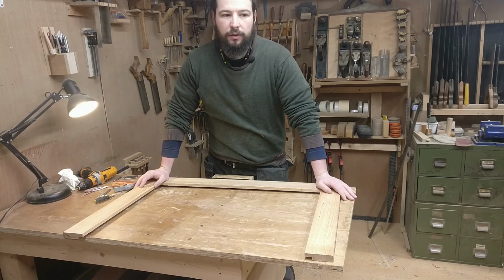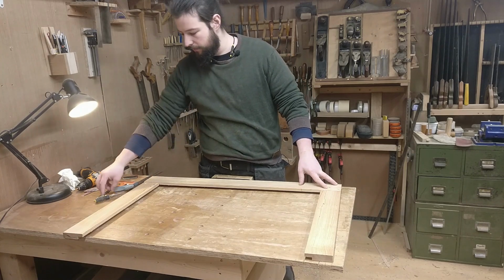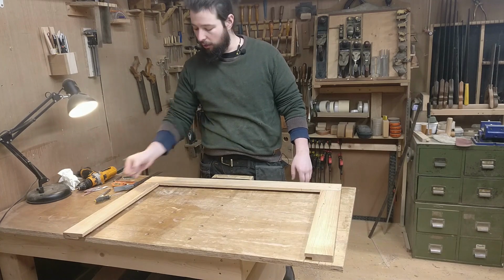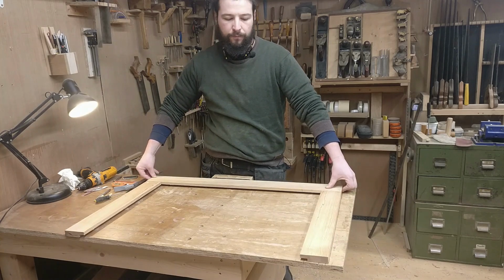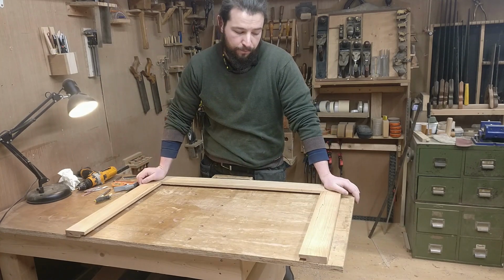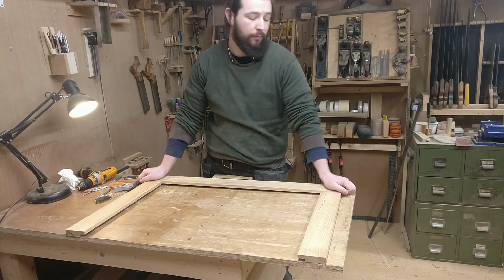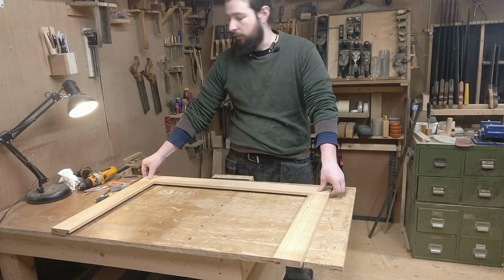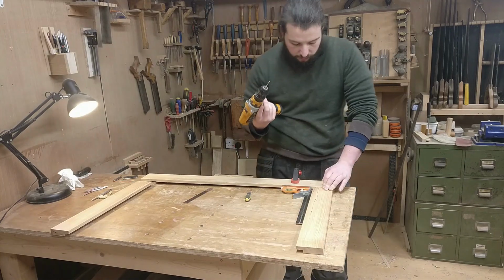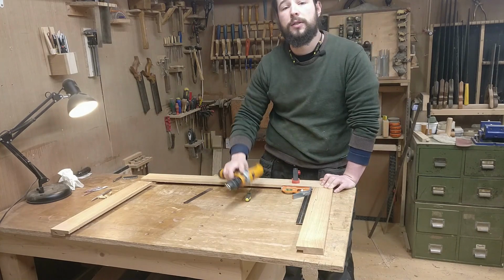for this, for a multitude of reasons, I'm going to dowel the lap joints. So I've cut my dowel pieces here already, just very slightly oversized. Now, the reason I've done that, first of all, is aesthetics. For better or for worse. I thought they might look good. I have no idea. Maybe I'll hate them. Who knows? But the main reason is for alignment. I have just a bit here for a pilot hole. That's all it is. And then I'll bring it to the drill press to drill the actual dowel hole.